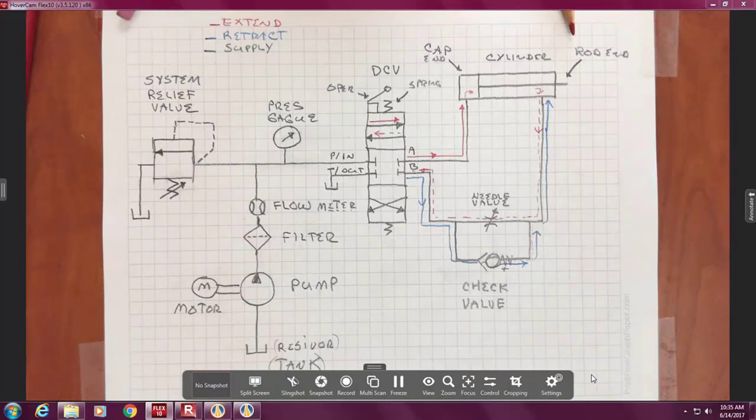Now maybe in packaging, you get really tiny pneumatics to do fast labeling things. The smaller the cylinder, the quicker it fills with oil or air. So you want to put 800 labels per minute? You'd need an ocean wave type of velocity to generate. So they get really tiny parts. Those check valves are probably expecting something different. And you'd have to couple 1/8 inch or 3/32nd hose to a 1/2 inch. Something's wrong there. If it came with a 3/32nd thread for bringing in the hose, it's not expecting a large one, and vice versa.